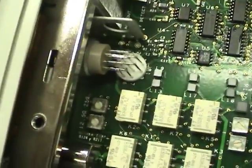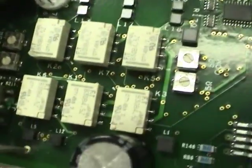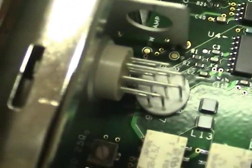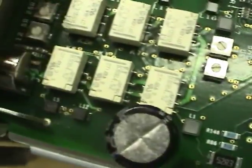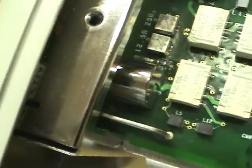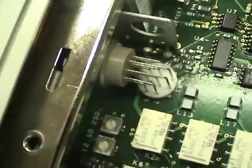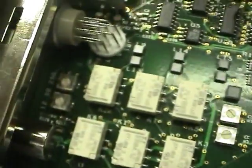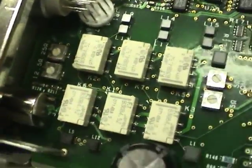I also noticed when the probe is off, these relays are in positions such that the signal from the Hall sensor transformer, or the sensor transformer output, can go straight through without any attenuators or termination to the BNC. And it seems that if you apply a high voltage to it, it'll blow those two 10K resistors and this chip. And it doesn't seem to damage anything else.